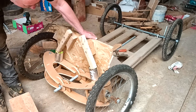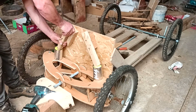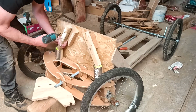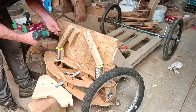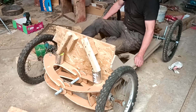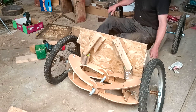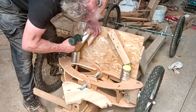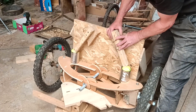But there are snags. Two round balls on top of each other would rather spring out sideways than go straight down when they're compressed. So there was a lot of sideways pressure on the bean tin and on the squashing arm. And of course, the arc of movement in the suspension arm complicates things too. So finding the exact place to put the squasher was tricky.